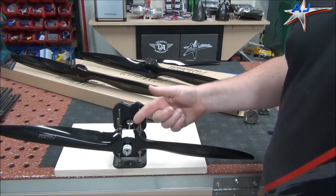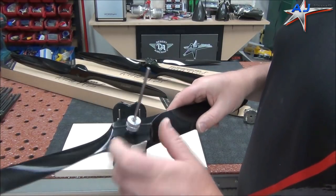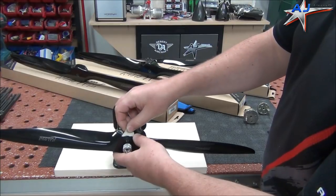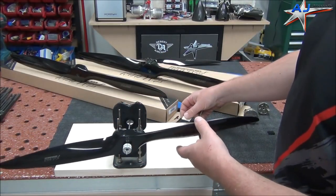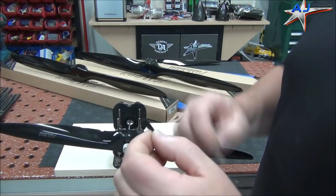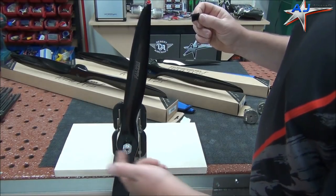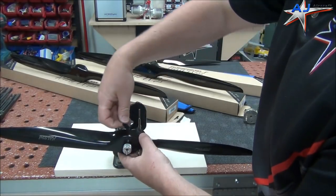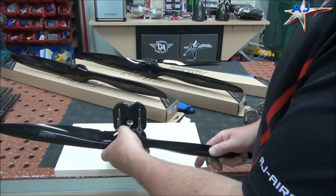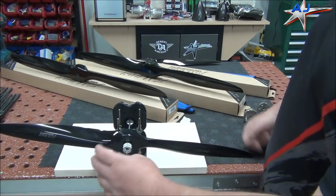So now you're saying how the heck am I going to add weight there? I certainly don't really feel comfortable drilling holes in the prop like they did from the factory. What we're going to do is something much more simple. Just a few layers of masking tape actually cured this one pretty good, so it's not going to take much. What you do to fix the hub is put a tiny piece of sticky-back velcro on that side of the hub. Heavy side goes over here. We're going to stick that right in the middle, press it down real good. You could clean it with some alcohol first before you stick it on there. Just because this one took very little, I'm going to check it with just the velcro on there.